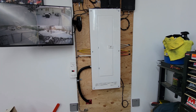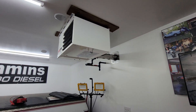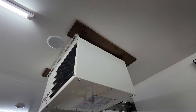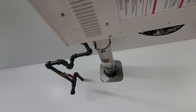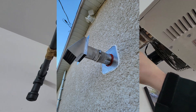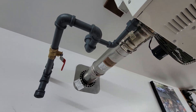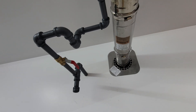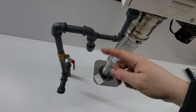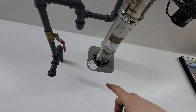Out here I also have a TV for continuous monitoring and display of the camera feeds. I got the heater at Princess Auto — it was on sale. I mounted it myself right to the trusses, drilled a hole in the wall, put in a wall thimble, and then had the gas technician come in. They did all hard gas line, which I understand is code here in Manitoba, and plumbed in a swing joint.